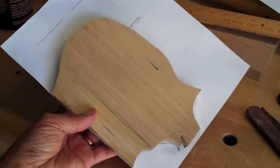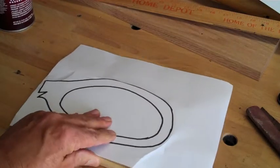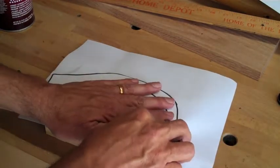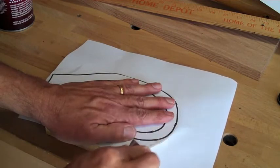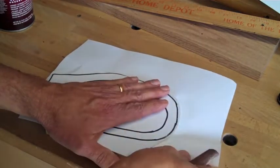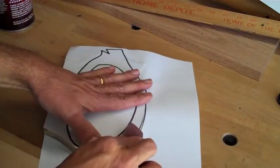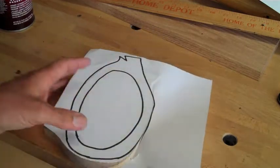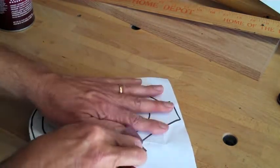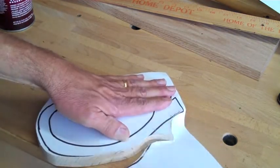You can see this is the back side of the paper that's been spray glued on. A little trick when you get paper around a piece of wood like this — you can just sand the edge, and as you sand it, it makes a perfect paper cut for you. It's a lot easier than even using a razor blade. So I'll just come along here and remove what I need to remove to make it easier to cut.